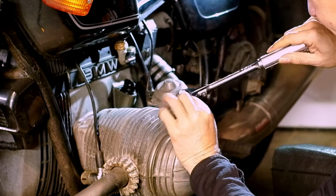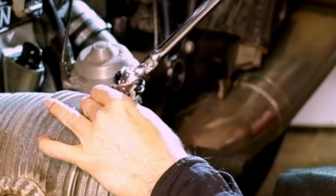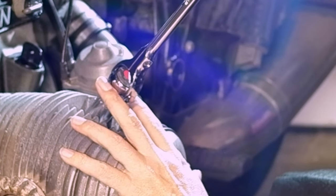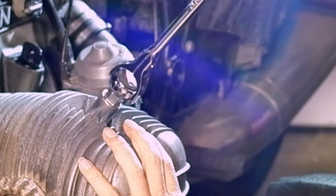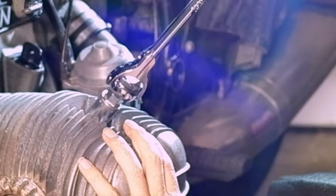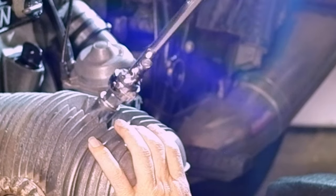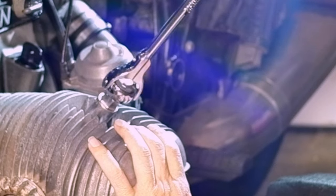Let's put it back on. It's barely on and there's not really enough drag — the resistance of the part is not strong enough to overcome the back drag even of the koken. So it's going back and forth but as it slowly gains a little traction it gets a little bit better, because as it gets tighter the resistance of the part starts to overcome the back drag. So now we're losing ground sometimes, but then you get a few clicks and it advances a little bit — so it is working.